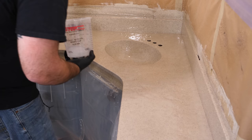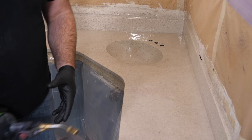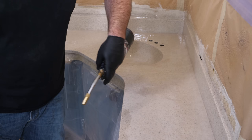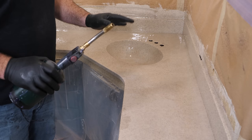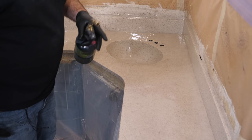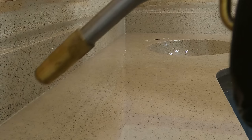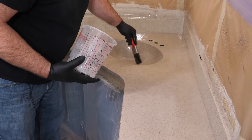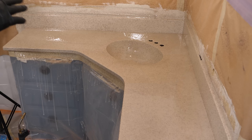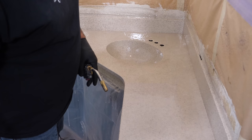This thing just comes to life. I think I see a bristle — yep. I'm going to grab a heat source and remove the air quickly using a propane torch. You can also use a heat gun in a sweeping motion. Cover the entire surface — this will probably take three to four passes. I'll watch the epoxy become crystal clear as the torch goes over it. Allow the epoxy to cool a minute or so in between torchings — it's difficult to overheat but it can be done.